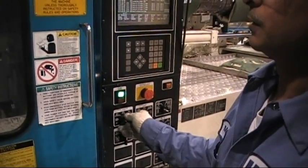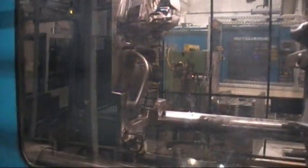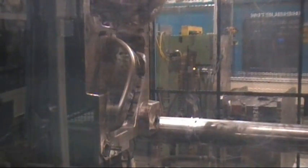After completely spraying the mold down with rust preventive and disconnecting all the water lines, advance ejectors forward then retract. Now you are able to close the mold.